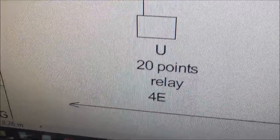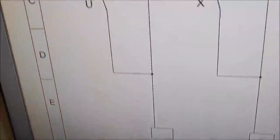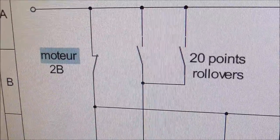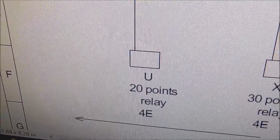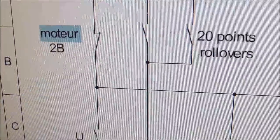All right, so I'm looking on my French schematics here. And this is what turns on the 20-point relay. I mean, this is the 20-point relay. Okay, and the way it gets power is you roll over one of the two 20-point rollovers. But like I said, that switch opens back up. This stays on, and then whenever it gets to a certain spot, you see it open for just a second, and then it clamps right back down. Right? So once you roll over the thing, it pulls in, but then the relay pulls in a switch on itself. So there's a switch on the U relay that keeps it pulled in